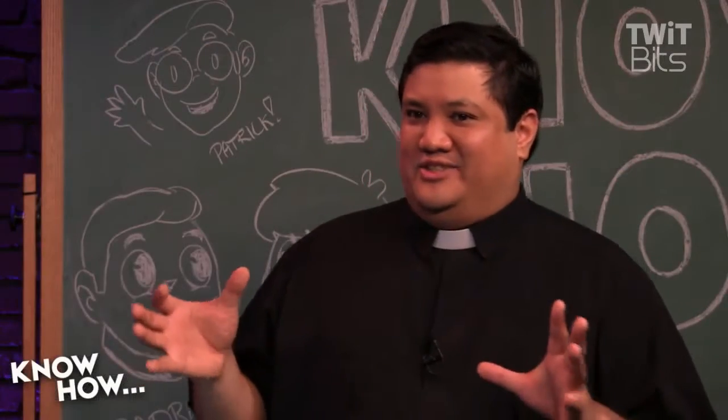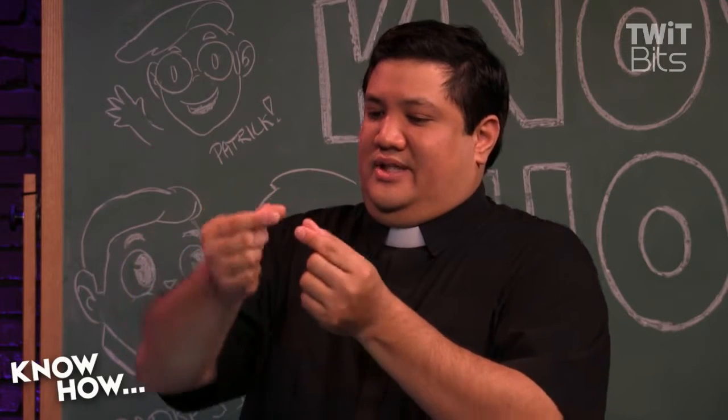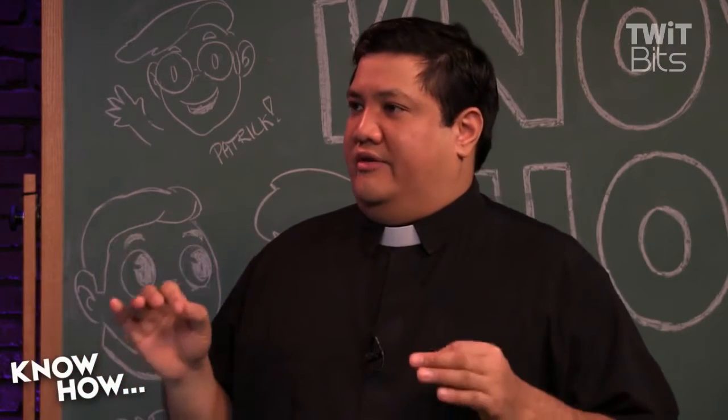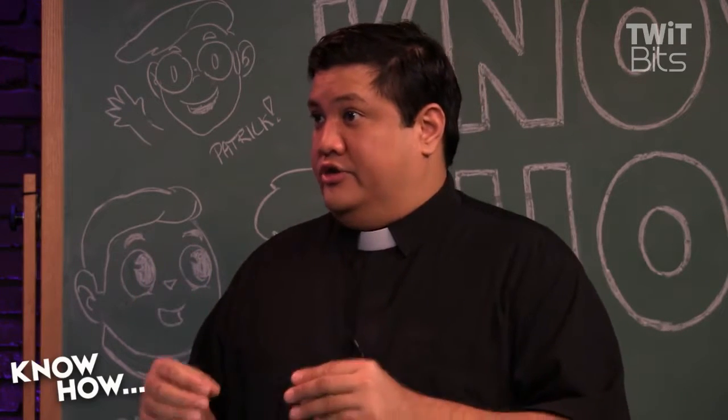This gives us a chance to talk a little bit about tech. This is a piezo element, piezo-electronic. Do you remember when we were doing the oscilloscope? There was that little component that looked like a little oblong steel container — that was the crystal, the timing crystal, the quartz. And that works on the piezo-electric effect, which essentially means I can convert mechanical stress to charge, or charge to mechanical stress. It goes back and forth.